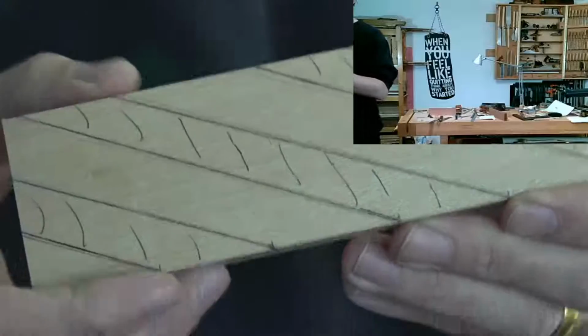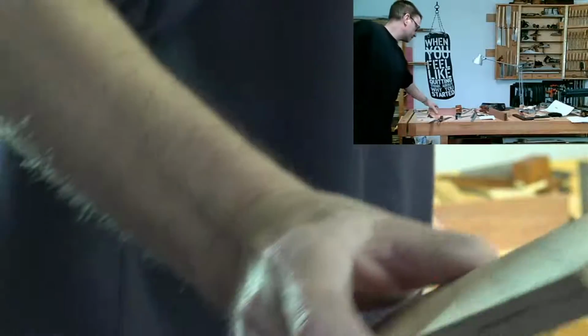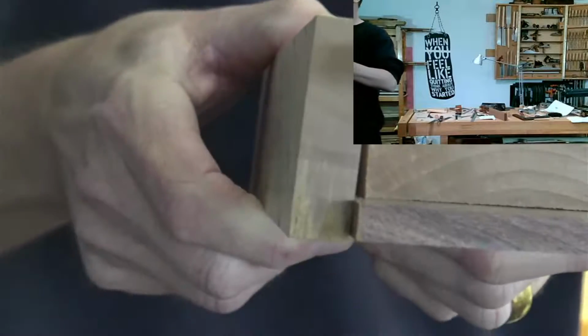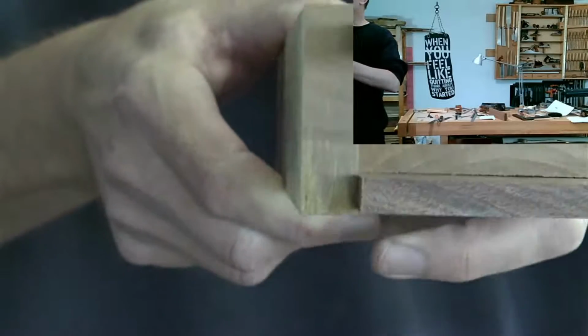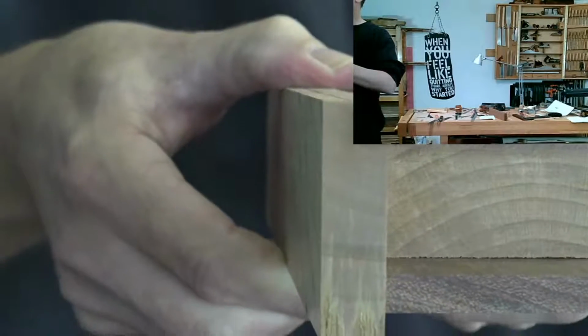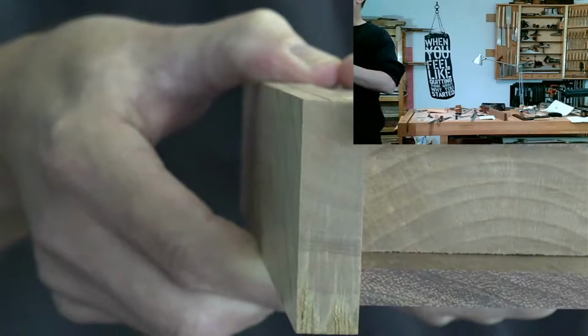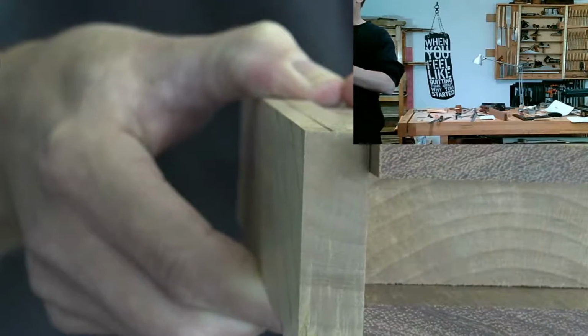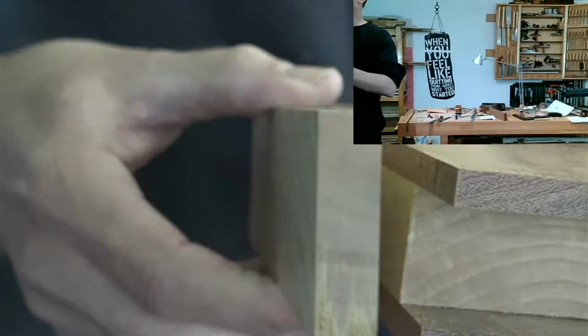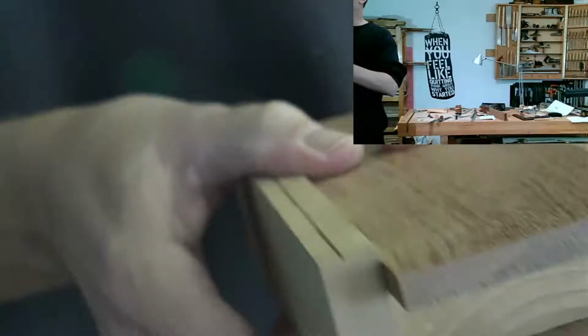And that's another reason why I've prepared this sole actually a bit wider than the plane body. So I'll design it so that it goes together almost flush on the far side of the tapers, but then when I put it together I can push it as tight as possible and still have plenty of material left over on the other side. And that can be trimmed off afterwards.